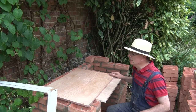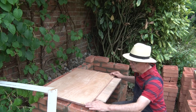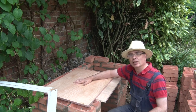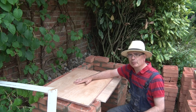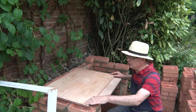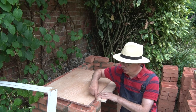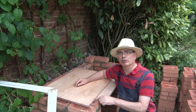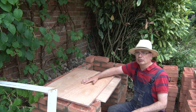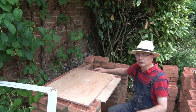Here we are at the end of the first day. Quite a long hard day. We've already started casting the slab for the bottom of the oven. What I've done here is I've used a piece of 18mm ply to go at the bottom of the slab and you'll notice that I've set it in about 50mm all the way around, so the concrete will actually rest on the brickwork. If this rots over a few years it doesn't matter because the concrete was resting on the brickwork and that will take all the weight.